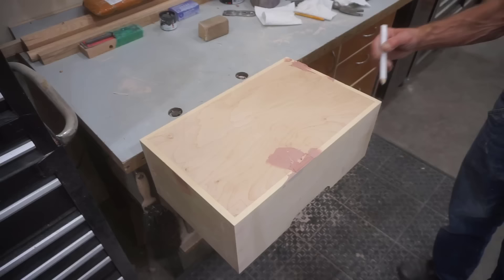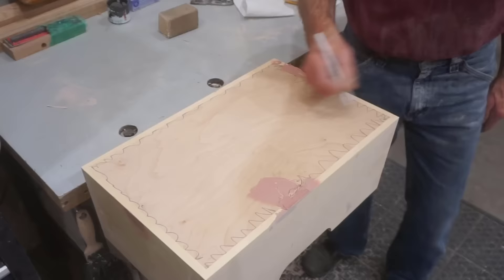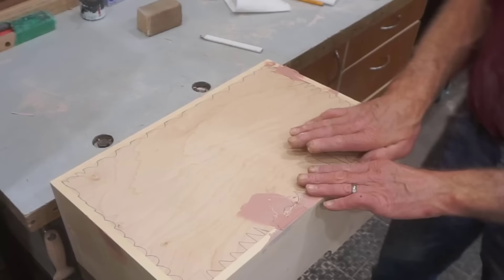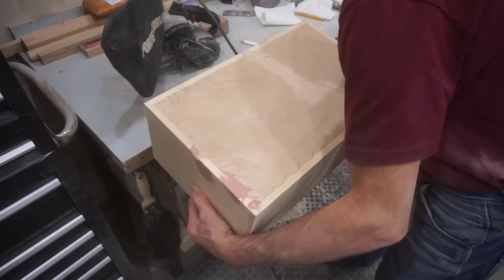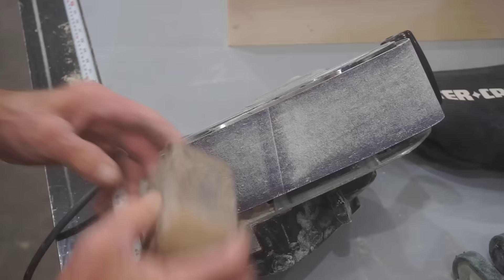If I turned the belt sander around the other way and sanded off the edge, it'd be too easy to roll that edge and make it out of square. A bit of metal showing through tells me a screw head was sticking up slightly and the belt sander sanded it flush — while not desirable, sanding them flush eliminates any problems they'd cause when laminating. I use a pencil mark to draw squiggle marks on the top — when the pencil stops, it shows that the edge of the side is sticking up. That's a good thing. Between sanding fresh Bondo and pitchy pine, the belt can get plugged up, so I use a belt sander cleaning block to keep the belt clean, predictable, and efficient.